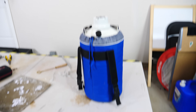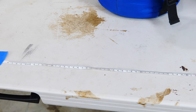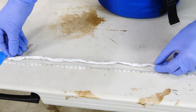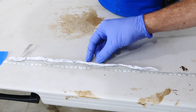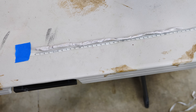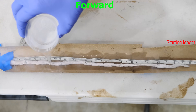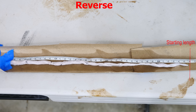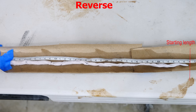Now we're going to cool it down — put it in our liquid nitrogen here. Now let's pull it out. We're right around 34 centimeters, so it's lost about a half a centimeter. I heat it back up and it gets back to 34 and a half centimeters. Here's a sped-up version where I pour on the liquid nitrogen while it's laying on the table, and you can actually see it shrink. This is the only situation where I've actually been able to see a length change due to thermal contraction.